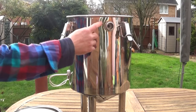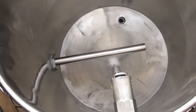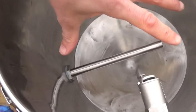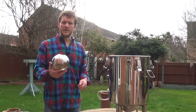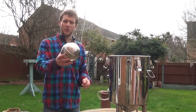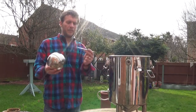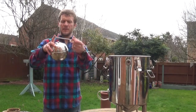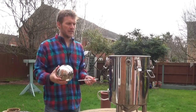The next thing I did was to drill another hole and insert a ball cock. You don't want it to be copper because that'll corrode pretty quickly — it's going to be hot in there and there's going to be slight pressure, and you certainly don't want it to be plastic. So I hunted around to find a ball and arm that were stainless steel. Now this ball is massive in comparison to the actual unit, so it's far too big and if I attached it to the arm it just wouldn't fit. I thought about bending the arm so it sits at an angle, but that's more complicated than it needs to be.